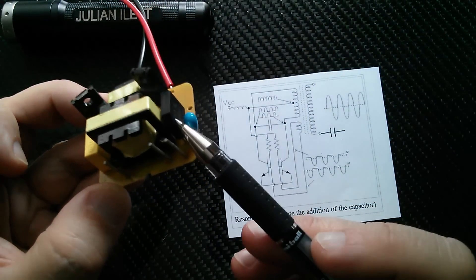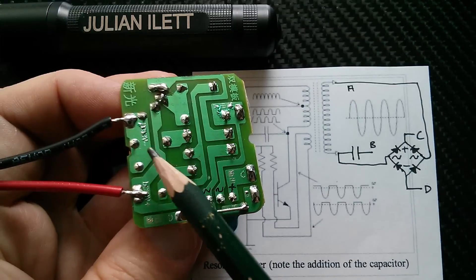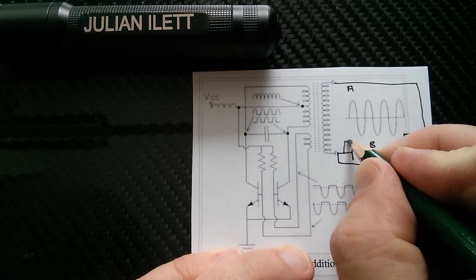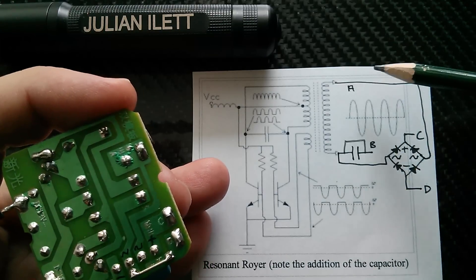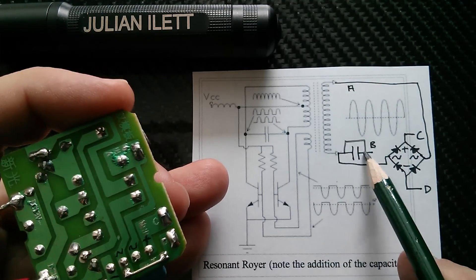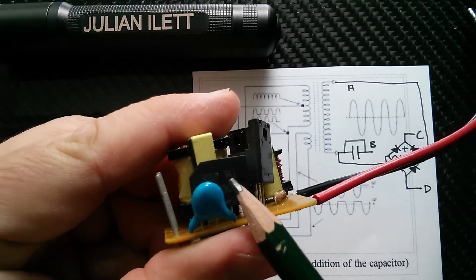Not quite sure why, but that's really handy for the application I want to use this for. The board has a number of lettered output points: D, C, B and A. I've added those onto my drawing. I've also shorted out this capacitor because I can't really see the point of it being in series with the AC output. I'm going to put a DVM on AC volts on A and B so we can see the direct output from the transformer. This point before the capacitor goes into the bridge rectifier, and then the positive goes to point C and the negative goes to point D — these will be my DC output when I use the bridge rectifier.